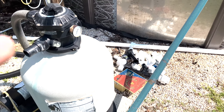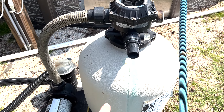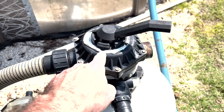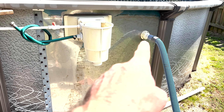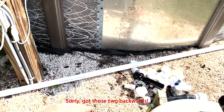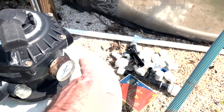Today we're going to be upgrading the tubing on a six-year-old salt system. The sand filter is made by Pentair - a pretty basic one with a six-way valve on top. Right now I'm draining the pool a little bit because that's my inlet for the pump. The outlet comes from the strainer basket down to the secondary basket, through the pump, through the filter, and then discharges here.